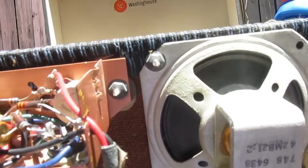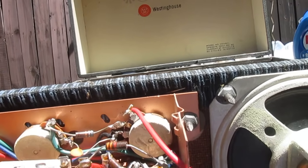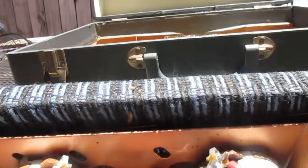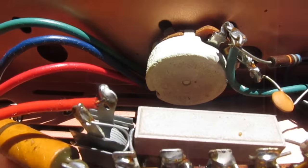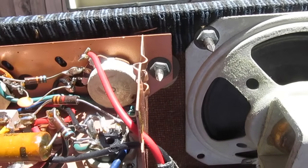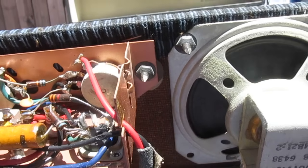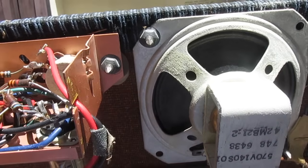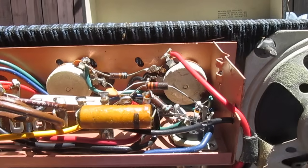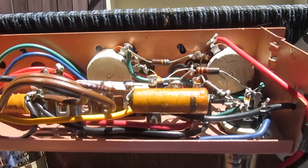Alright, here's our amplifier exposed, little one tube wonder job, meaning it requires a 3-volt cartridge, a couple of paper capacitors, a selenium rectifier. And yeah, this was about one of the last tube ones I believe that they made. In fact, I know Westinghouse made a solid state version of this same record player, so this was definitely made during the '64-'65 transition era.